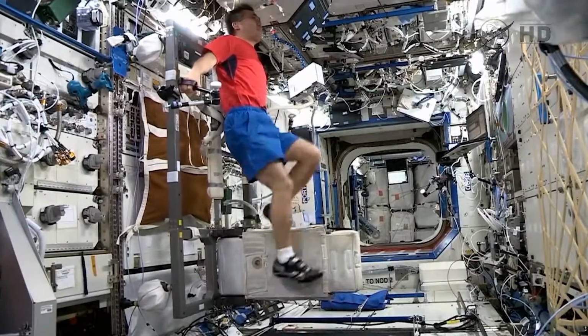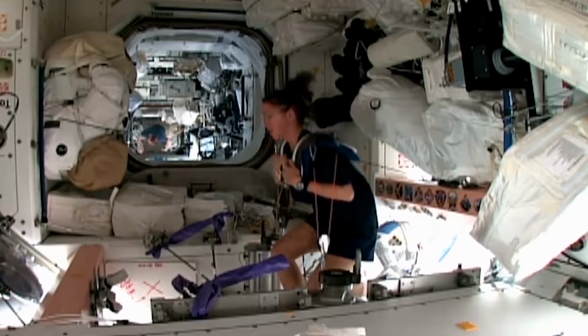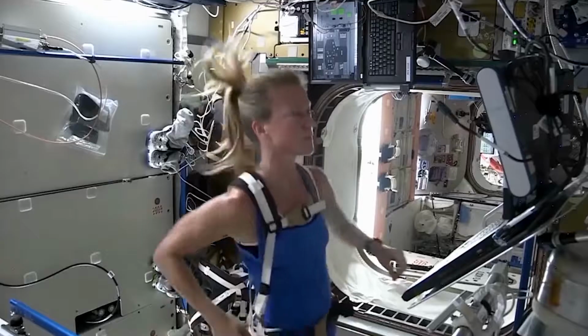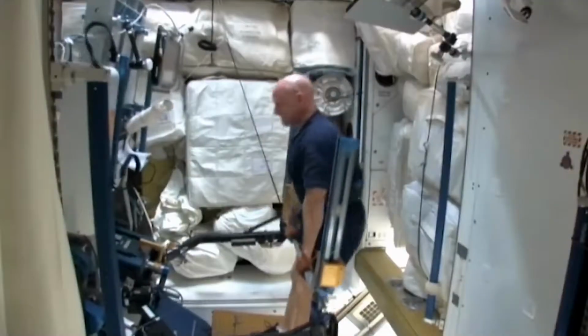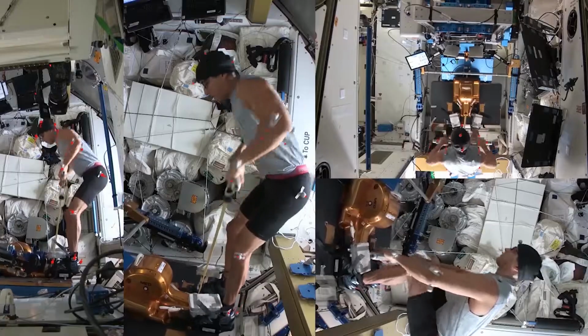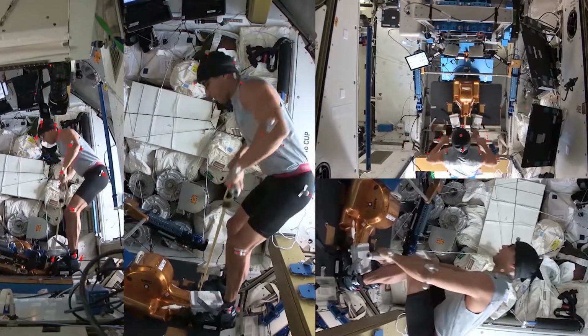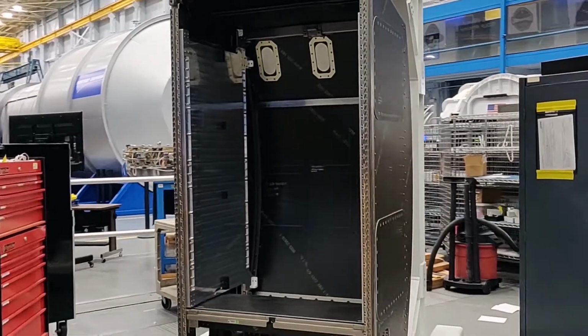In exploration spaceflight, our crew members are going to be asked to do partial gravity EVAs, and in order to do that, the exercise hardware needs to sit in a vibration isolation system, and it is important that it interacts well with the exercise hardware and allows the crew members to perform high-intensity aerobic exercise and high-load lifts such as squats, deadlifts, and bench press. Other challenges with the exercise system, which includes the VIS, would be ensuring that we can have minimum power, up mass, and operate within a limited operational volume of these small confined vehicles.